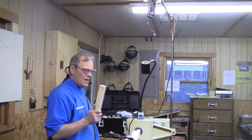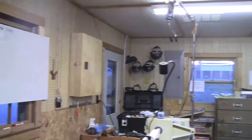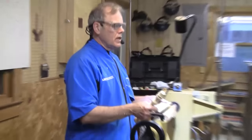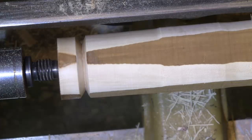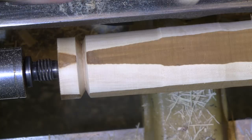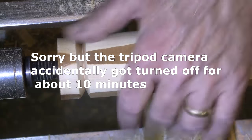This is a great way to practice. The approach I used was to make a little template — this is actually for practicing spindle cuts, but the same approach works for making beads. Get a little stick, cut little V's on it so you can be consistent, then just start making beads. First do your peeling cut practice, then your planing cut, then work on V-cuts, then work on beads. Put a date on it, throw it in a box, do it once a day or once a week — however often you can get to it. By the time you get through that 2x4, you're going to have a fairly high degree of confidence using the skew.